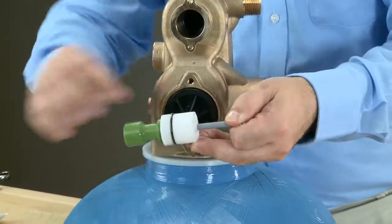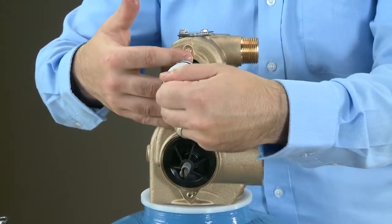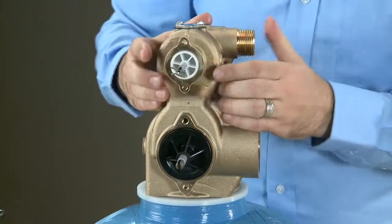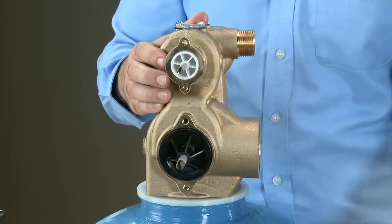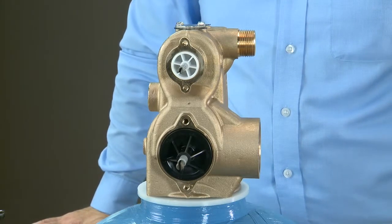We add a small amount of the lubricant to the O-ring on the end cap. We then place the piston into the center of the bore, pressing down on the end cap to seat it within the body. This piston will also sit out from the body the same as the lower piston and will compress when the drive assembly is reinstalled. The remainder of the reassembly is the reverse of removal.